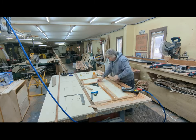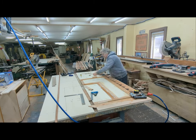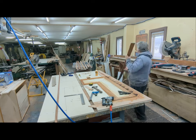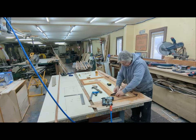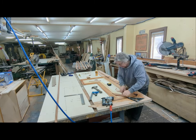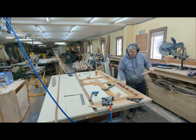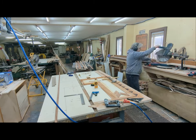My opinion: frame it out first. Go there with the square, make sure you're good, and once you've got it framed out you can see how much room you have and what kind of design you'll come up with. I don't really care about being exact width-wise or length-wise, but I'll do it within reason. On this one I just did simple 45-degree cuts down the center — that's really it. All those angles are 45 degrees plus straights.